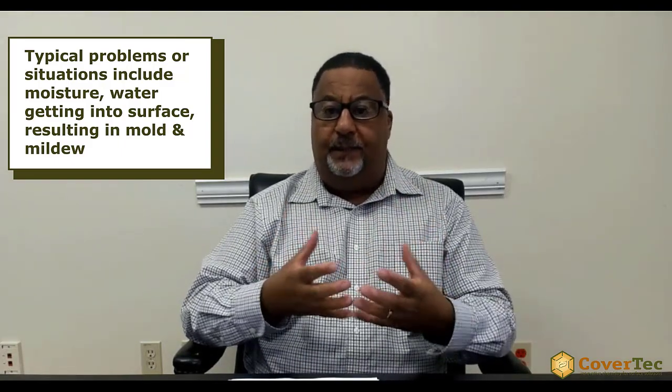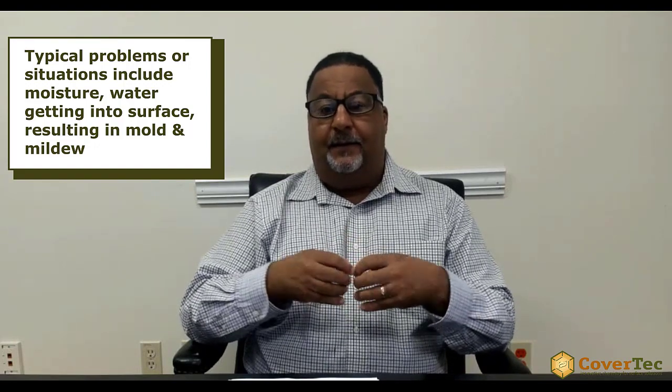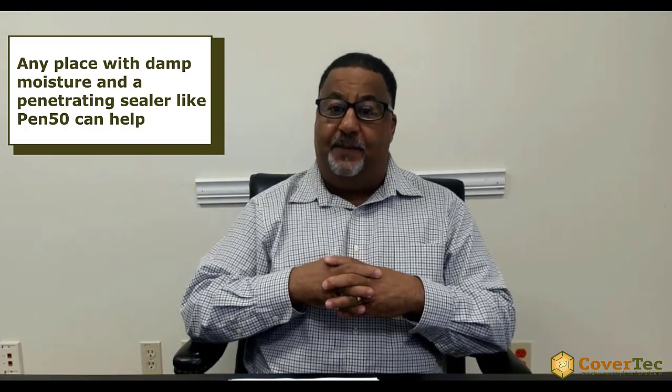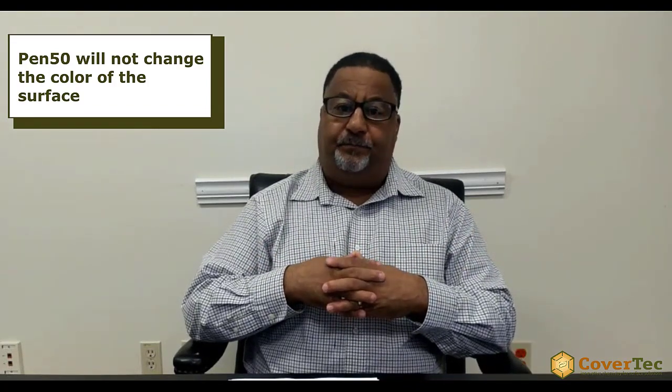So typical problems where you would use the Pen 50, first of all, include moisture or water getting into your surface and resulting in mold and mildew. Predominantly we're dealing with exterior situations, for example natural stone like limestone or sandstone, maybe in your patio, maybe around your pool deck, maybe on brick walls or vertical surfaces, anywhere you might have a lot of damp and moisture and you want to stop that getting into the surface. That would be a great application for the Pen 50. And the nice thing is that you can use it and not change the appearance of the surface. It shouldn't darken it, it won't give it a sheen, it'll just keep that natural look.